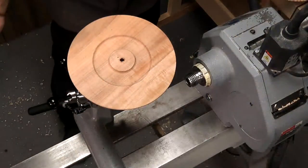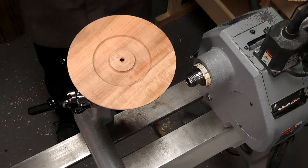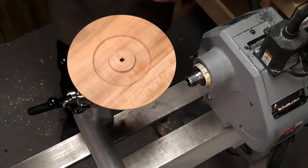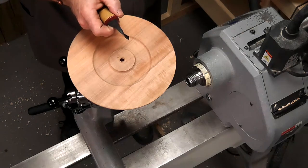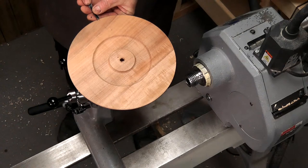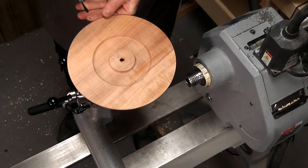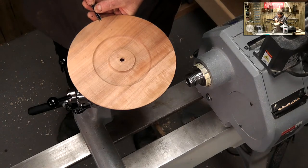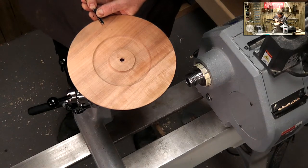Now what should we start with? I'm going to get my glasses. Let's have a look at what I did the other day, try and get some inspiration. Which way do I want to go? Come down through there. So I've got a V tool. I'm going to start right on the edge. I'm using my fingertip as a guide - I don't want to come in too deep. I've made sure things are nice and sharp, so I can push straight.